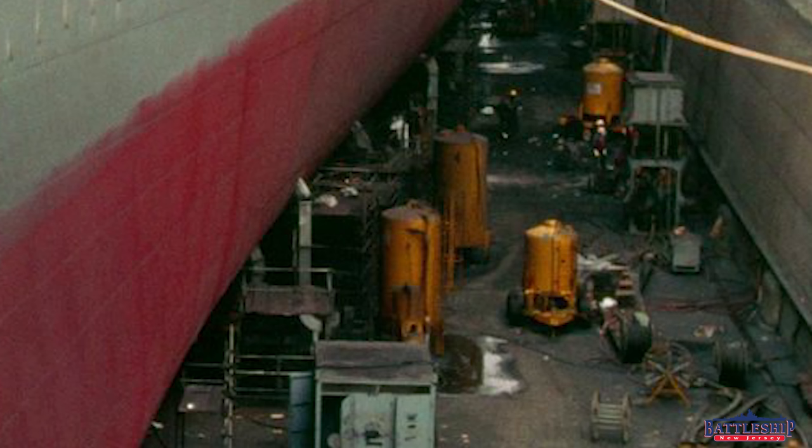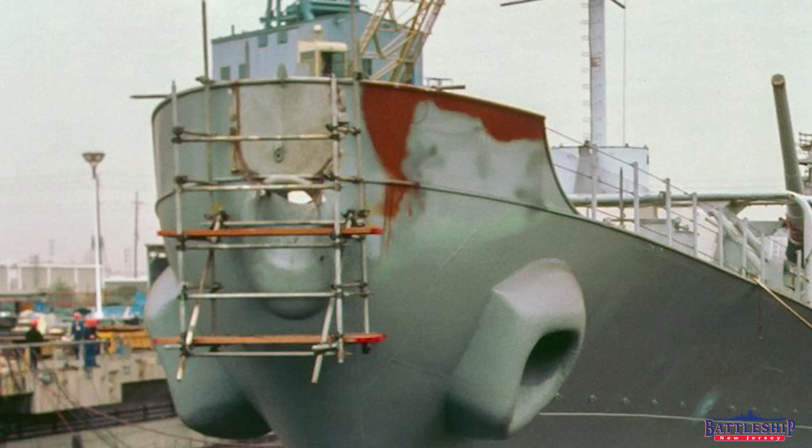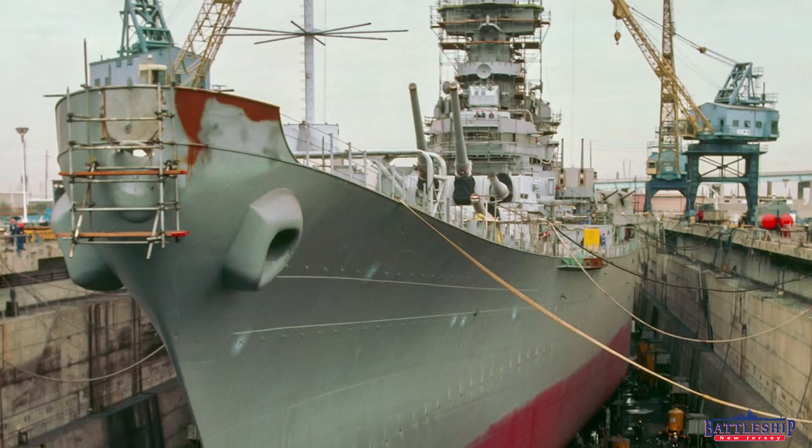Moving up and staying at the bow of the ship, you can see at the extreme front of the bullnose there is scaffolding built there hanging off the bow. There is a notch that's been recently replaced that was cut out of the bow. For whatever reason, when the ship is towed, they cut that free to run the mooring line over it instead of playing it out through it like it would be in service. Then when she gets to drydock, they weld it back into place. If you come and visit the ship, you can see those cut marks — actually a couple of them around there where it has been done several times throughout the ship's career.